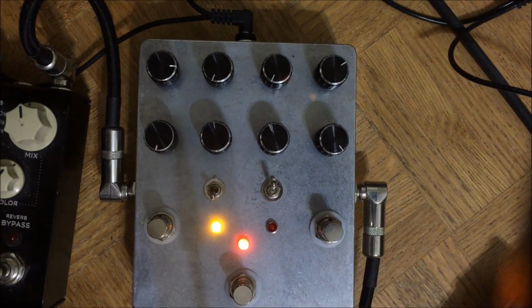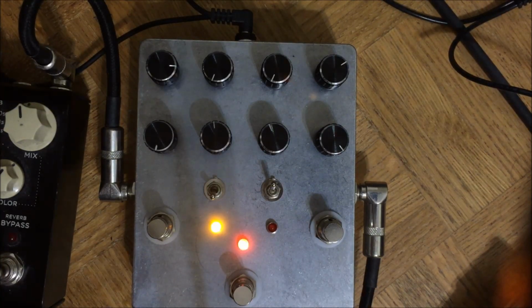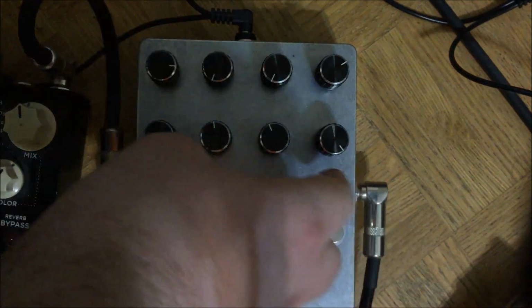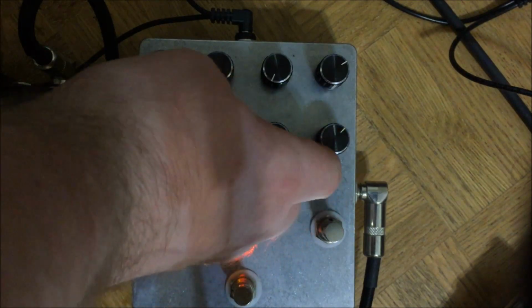it is just a straight up boost pedal. It's not a huge amount of gain, but it's enough to lift your signal up, especially when you're using a Telecaster or something. And then the way it's set up is with an inverting op-amp gain stage. And the values I chose, you can make it so that you can go to less than unity gain as well.